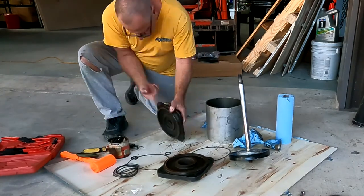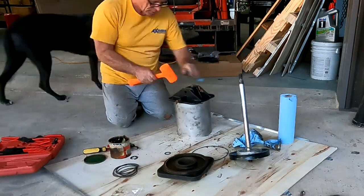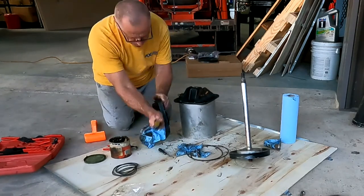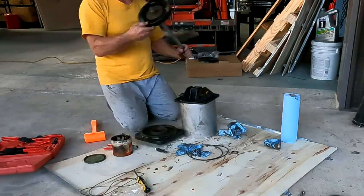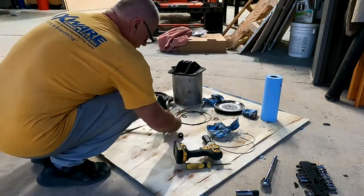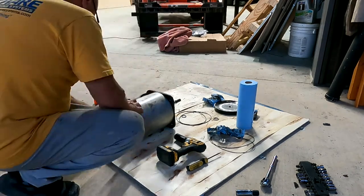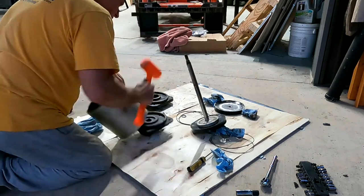The tire machine actually worked, but the breaker was extremely weak on breaking the tires loose, so I just rebuilt this cylinder. He claimed he had done that — I think the piston inside was new and the o-rings were okay — but I changed it anyway since I had the kit already. I'm putting the piston on there, shoving it in the cylinder, buttoning that part up, and the rest of the fix was just putting new airlines and a couple of fittings on the thing.